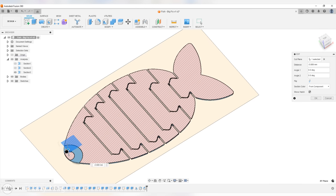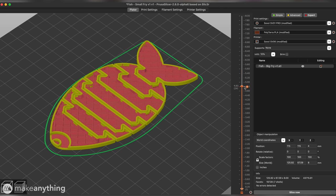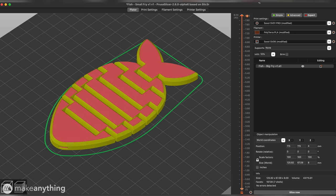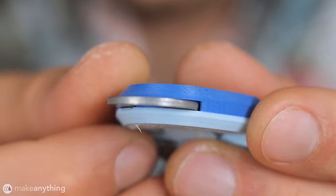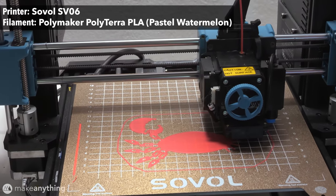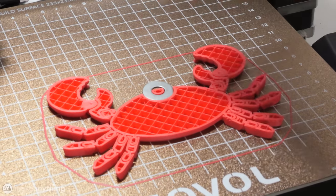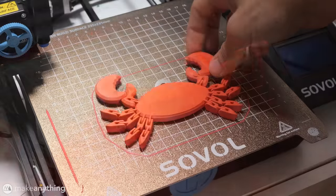It's a pretty neat trick that's made possible by the fact that FDM printing builds up parts layer by layer. That same fact actually makes it possible to embed these steel washers, so they're totally locked into place. To pull that off, I simply programmed my print to pause partway through, so I could drop in the washer and then resume the print. The printer then extrudes over the washer to enclose it within the print.